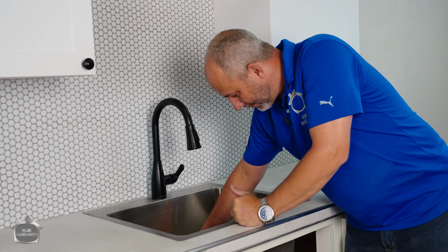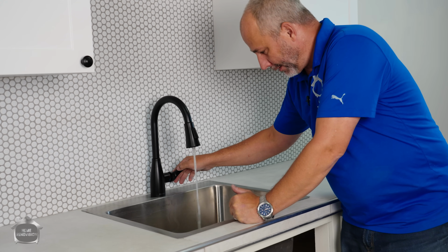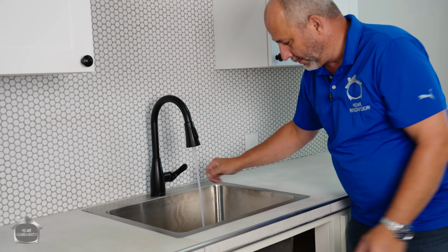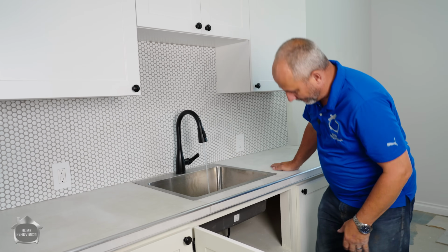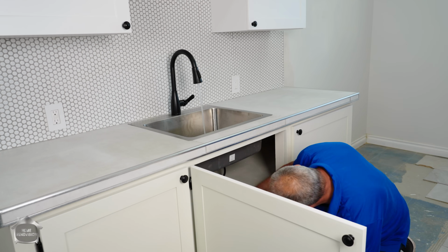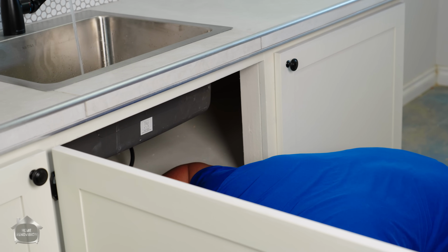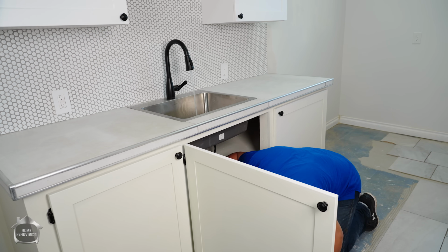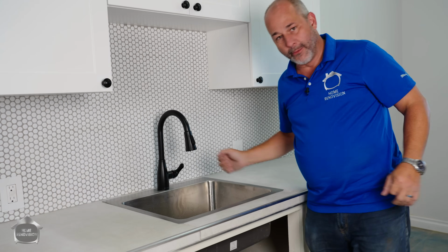What you want to do is two things. First, we want to just set the cold water and just let it run a little bit, okay? Just the cold. You're going to want to run this for like 15 or 20 seconds. It's going to have air in it because we had to bleed the lines. Look for anything that's obvious first. Check the basket, the collars. All right, the first inspection you're making is to make sure that everything is glued together properly and there's no obvious major leaks. Yay, we passed that test.